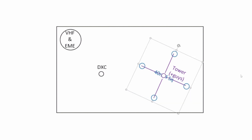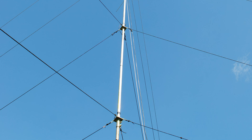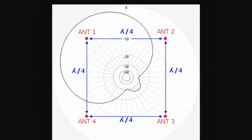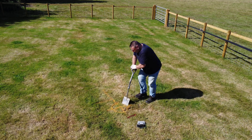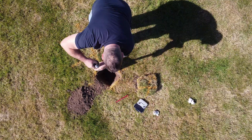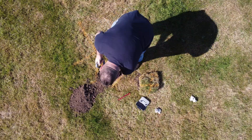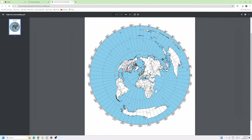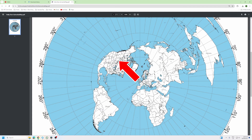So we've got four verticals to make the 40-meter four-square, and a directional antenna — a quad — at the top. Why a four-square? The gain is about 5 dB better than a single vertical, like doubling your power twice. But the front-to-back ratio is remarkable — you're effectively not hearing anything behind you, which makes receive even better. The maximum gain is off the corners, and I've oriented it at 315 degrees northwest, giving good coverage to VK, ZL, and the US.